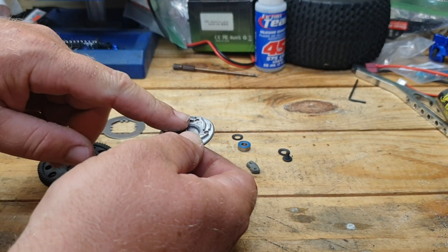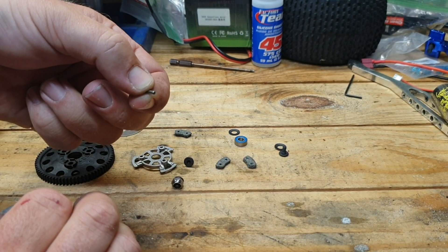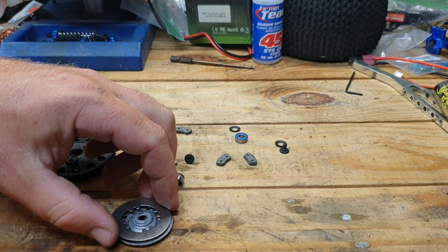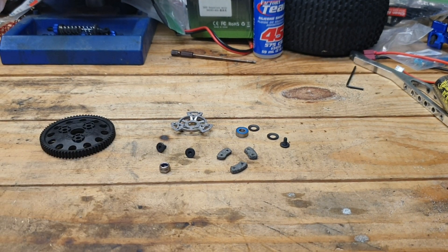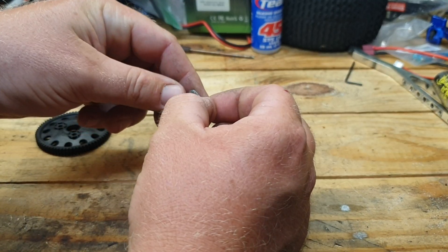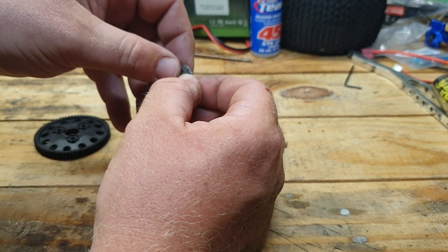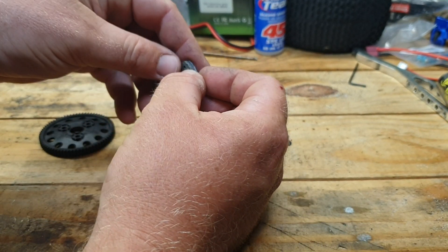This piece here will go onto the shaft and slide on, but you'll have to put in the pin they give you on the shaft first. Put this on the truck on the shaft first, then this will slide in. If you look, this has got a key in it, so it'll key right in. Once all that's on, take the shim and slide it right over it. Then we'll have to assemble all of this. Go ahead and put the friction pads on these pins — you can see they've got little raised pins. Apply even pressure so you don't snap these pads, and it should just slide right in. You want to do all three of them with even pressure — don't force it. Make sure they slide in nice and tight.